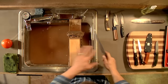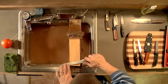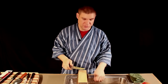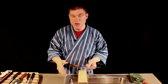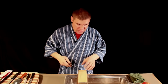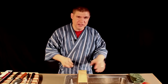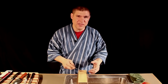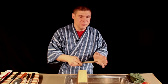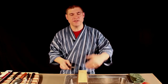Now, by the way, we've just worked on 4 knives here. That little Buck folding knife, that Japanese cleaver, the kitchen paring petty knife, and this 8-inch slicer. This is a way I recommend for you guys to learn how to master sharpening: work on a batch of knives. The advantage is that you get into the swing of things. You grind that secondary edge, as in step 4, and you grind one knife, then you grind the other, then you grind the other. You start to get really in the swing of things. You look back to the first one you did, you see that you could have improved a little bit, you do a little bit more, and then you move a whole batch of knives through the steps. You'll make progress a lot faster than if you work on one knife from start to completion.